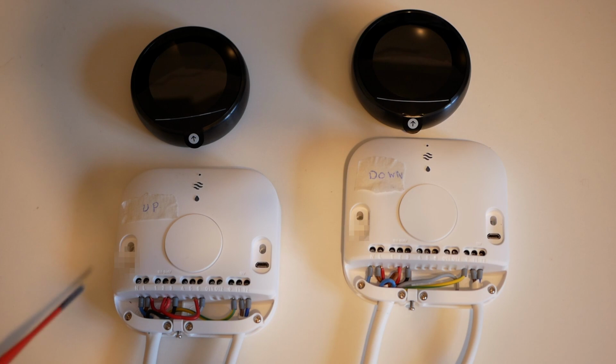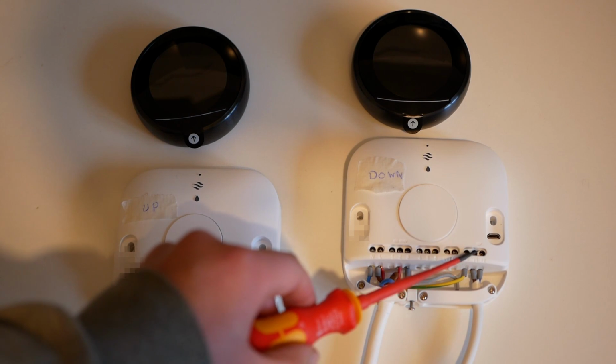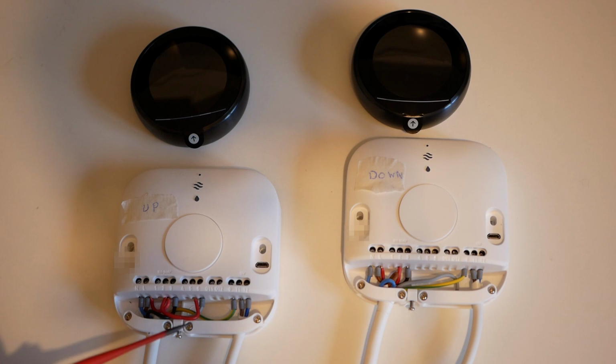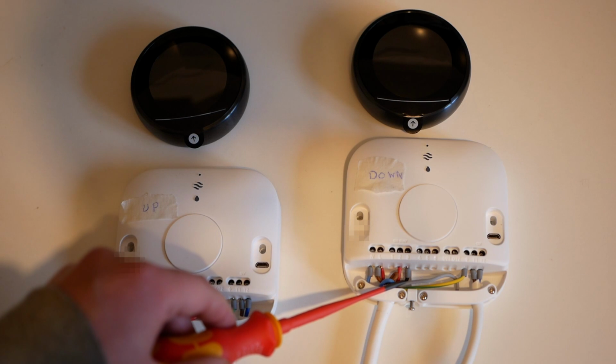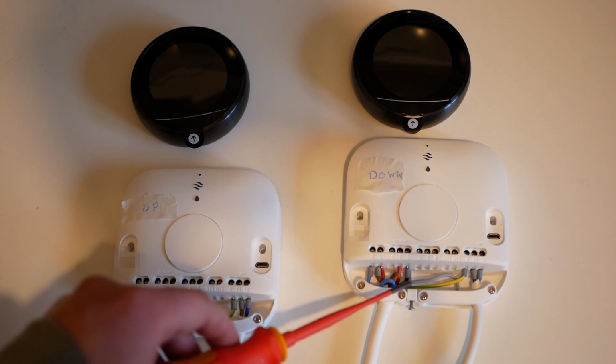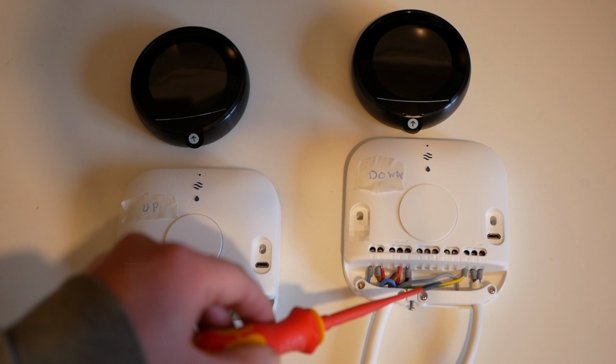I've got my wiring done for the 2 Heatlinks now. In both cases I'm using a 2-core flex for terminals T1 and T2 and a 5-core flex for the rest. The Heatlink for upstairs has its black and grey wires between terminals 3 and 6 for central heating and hot water, whereas the Heatlink for downstairs is just using the central heating. The grey wire is unused, so I've just snipped that and folded it back on itself for safety.